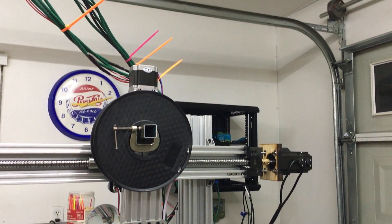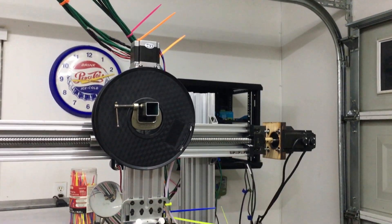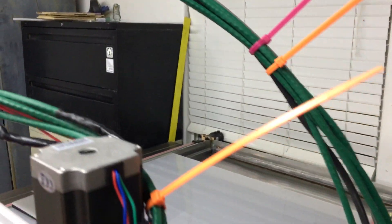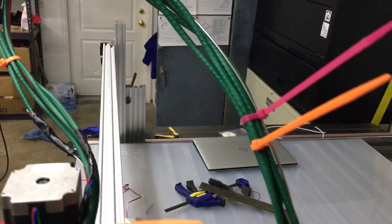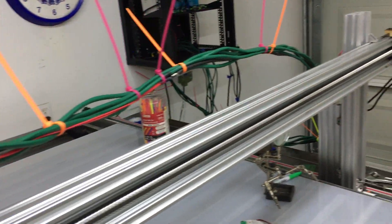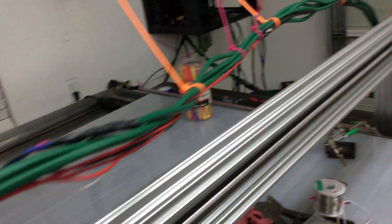I've got this guy-hook wiring system — think fishing pole with wires on it. It's zip tied to a little metal rod that provides some buoyancy skywards for it, and it will lay down over there and then get held up when it comes on this side. Then it runs back into the control box. This is what it looks like when the X carriage hits its end stop — it just sort of has a little umbilical cord, and then all the wires just run right off of it, straight down and over.